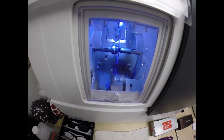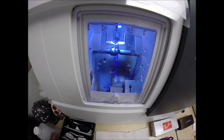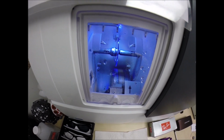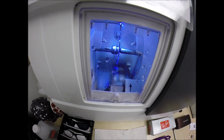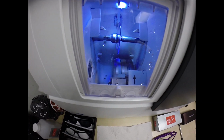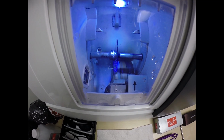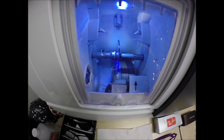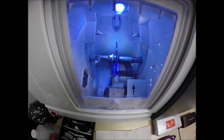And the old carpenter saying, measure twice, cut once, is measuring the thickness of the lens at every point to know exactly and precisely where to place the bevel, so you have the least amount of edge thickness showing, which again, you will have none in this frame. Now the lens will drop down onto the cutting wheel. The light you see flickering in the back is water. That's there to catch the optical sawdust as it comes off the cutting wheel.